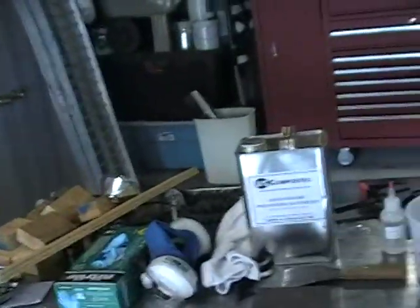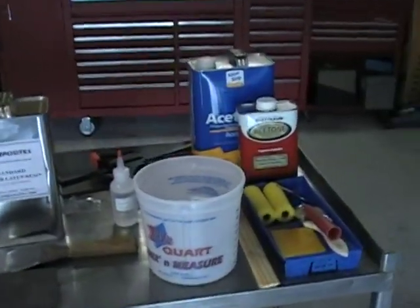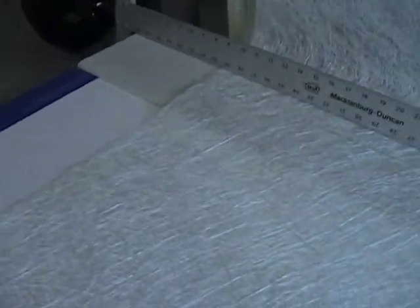What I'm going to do now is get started making all my cuts. I've got everything set up for my peanut butter mix. I'm going to make all the cuts on the fiberglass first, get all my pieces laid out — I'm making three layers, so I'll have several cuts to make. Then I'll mix up my peanut butter, lay it in the edges, and try to tape most of that. Then I'm going to do my fiberglass layup. I'm a little concerned I might not have enough resin, but we'll find out. So we'll see how far I can get this morning.